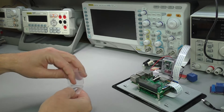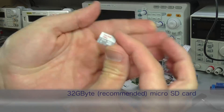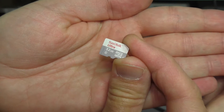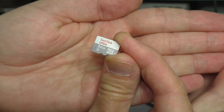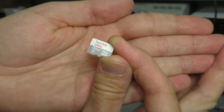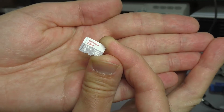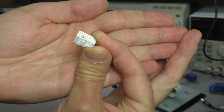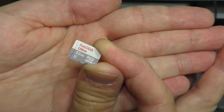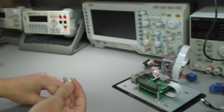You're going to need storage. I recommend an SD card of at least 32 gigabytes just so there's ample space to store the operating system plus all the images and videos you'll be taking with your camera. The total size of the application itself with all the libraries and icons is not that much, so if you don't have a 32 GB card you can get away with a smaller one like 16 gigabytes.